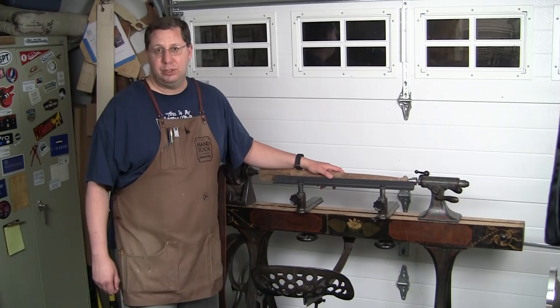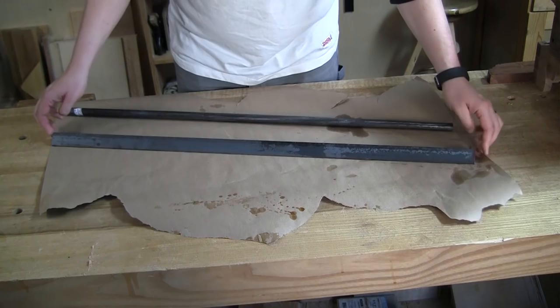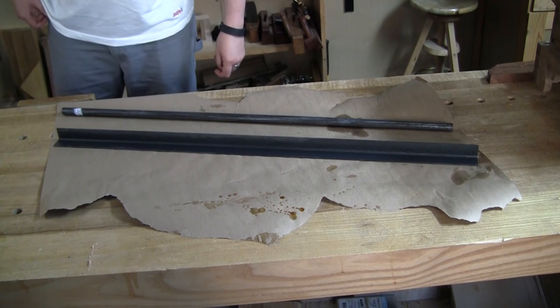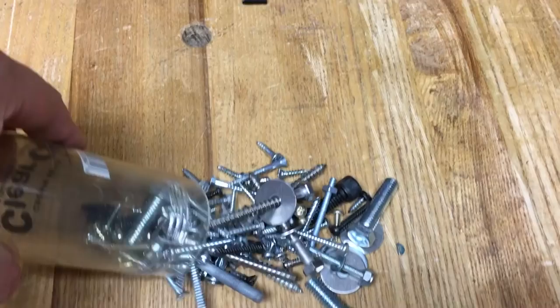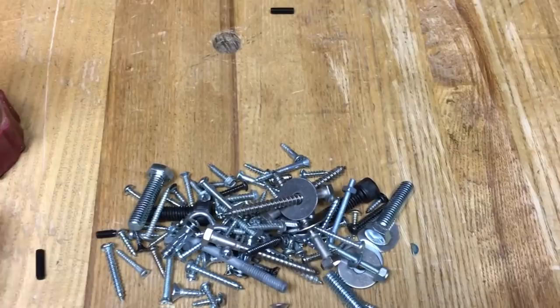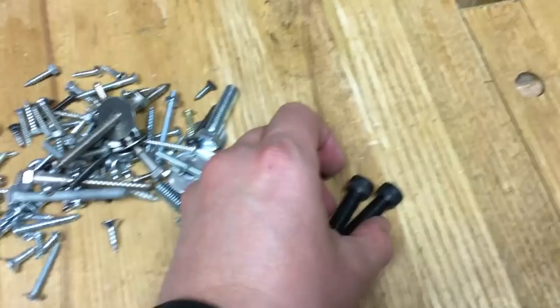To make this tool rest, you basically need to make a trip to Home Depot. I used some one-inch by one-inch, eighth-inch thick angle iron — all I could find was 36-inch lengths — and I used some steel rod that matches the banjos already on my Barnes lathe. If you're trying to match a banjo, you need to capture the inside diameter of your banjo. I used Allen screw head three-eighths inch by one-inch long bolts for threading the whole thing together. If I were to do this again, I'd go with a shorter bolt — the one-inch bolts yielded way too much drilling and tapping of steel.